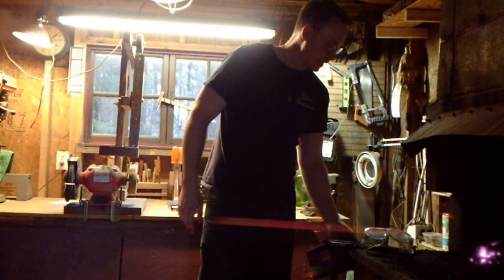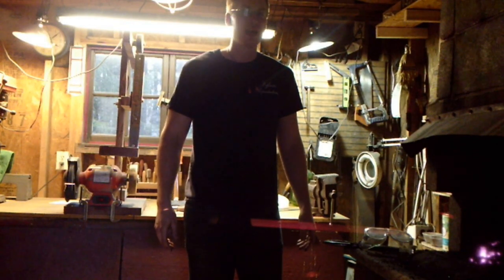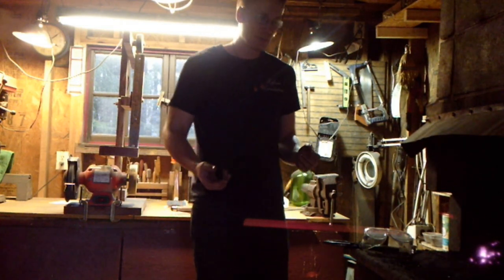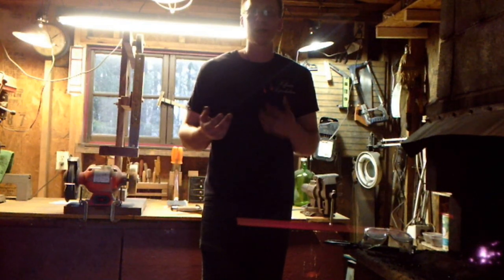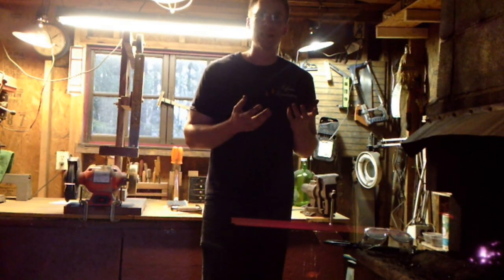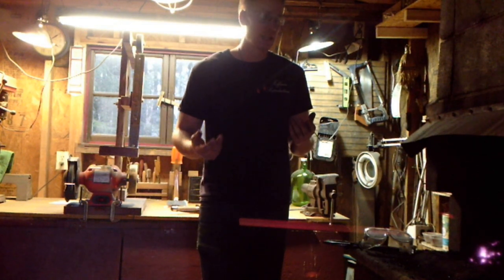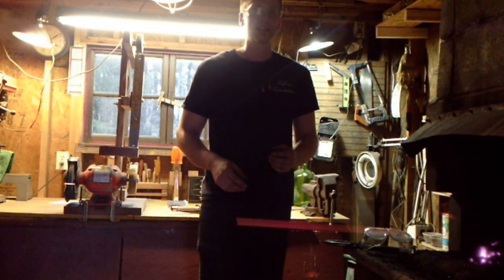The type of knife we're going to be making is a small standard patch knife, and we're going to be forging it out of 1084 tool steel. Traditional tool steels comparable to what they had in the 18th century are 1070, 1075, 1080, 1084, and 1095. Basically what that means is they're simple carbon tool steels — mainly comprised of iron and carbon, not like modern tool steels with alloys and chromiums mixed in. The makeup is basically the same as the 18th century, which if you're after a historically correct piece, you want to stick with those steels.